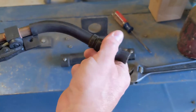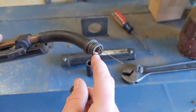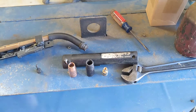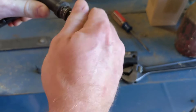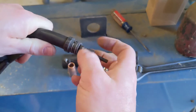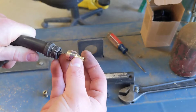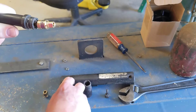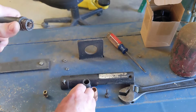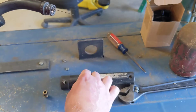This piece is completely worn out. What I want to do is make an adapter. This is 1/8 inch NPT threads on the old style - it just has slits cut in it, threads up in there, and your contact tip threads on the end. I want to replace this with an adapter that fits this and accepts the new style contact tip on the end, along with the nozzle, so we can use new style Miller parts on this old torch. You just can't buy these anywhere - they don't exist.